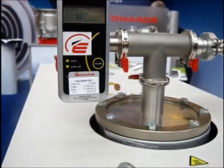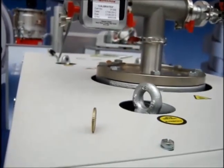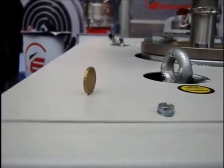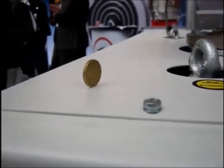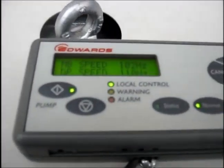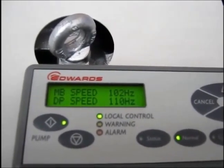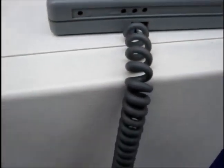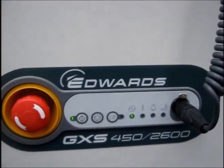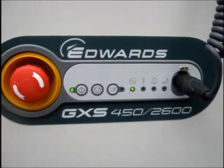This reads under range on the gauge used at the show. Even at full vacuum pumping speed, the pump has extremely little vibration and the coins remain in place. Normal full speeds are 110 Hz for the dry pump and 102 Hz for the mechanical booster. This GXS is now providing its maximum pumping speed. The Edwards GXS gives high vacuum performance and low operating costs, and with its standard dashboard control panel, provides true plug-and-pump capability.